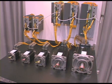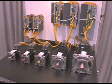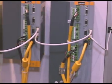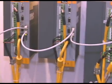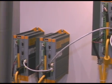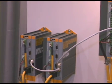Here we have the five axes of our Compax 3 servo drives connected to the 9040 multi-axis controller over the Ethernet cable, and you also see our MPP industrial-strength servo motors. The Ethernet cable shown here is the motion bus communications from these servo drives back to our multi-axis servo controller.